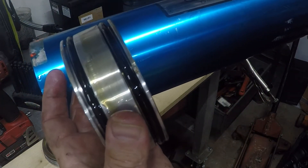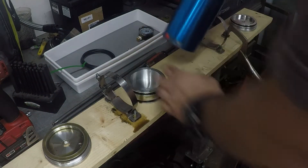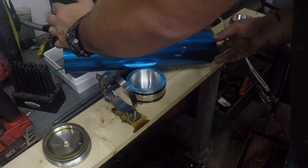The pressurized side basically always has like nine or ten PSI in it because that's what you set it at. The engine side changes depending on what engine you have and whatever your oil pressure is. Our goal is to clean each of those components up, get them nice and free of any oil, grime, dirt, or metal from my engine, replace all the O-rings, and then put it all back together — pretty simple really.